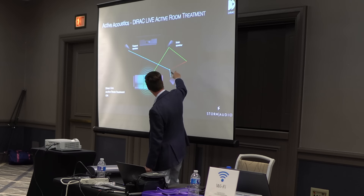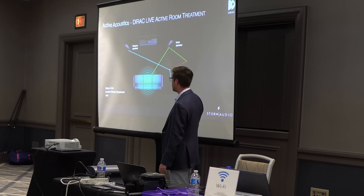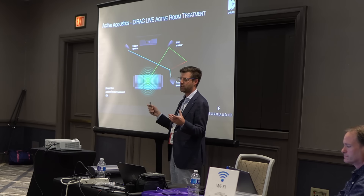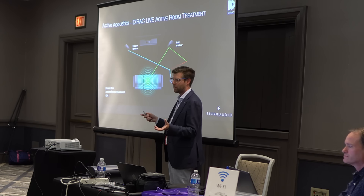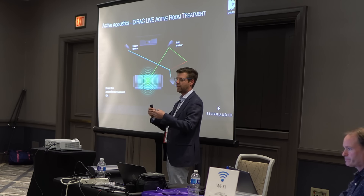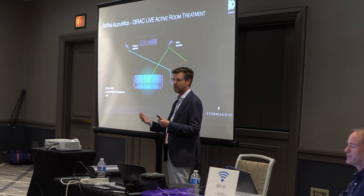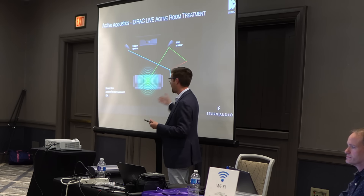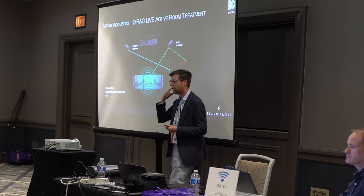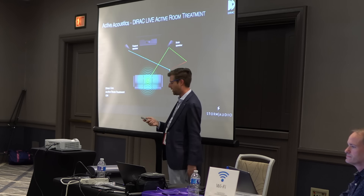As you can see, this is about using the speakers to cancel the reflections. One of the problems with these approaches is that this is talking about it in a perfect sense, as if these cancellations are perfect — they're not. You get partial cancellation. What happens is a portion of that wave cancellation is canceled, but not all of it is equally canceled, and a portion of it gets through. So you've got this recursive signal that was supposed to be canceled as part of the cancellation process, but if a portion of the signal gets through, you hear it — that's a distortion it has created. This has been an issue with these systems in the past.